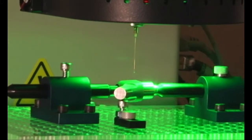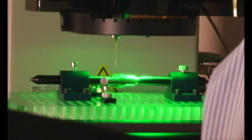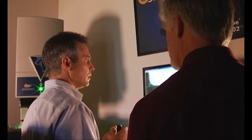The stylus itself is oscillating at a very high frequency, so it's an excited stylus rather than just a static stylus. And as that stylus is vibrating and comes into proximity to a surface, the surface disrupts its vibration and changes the frequency, and that change in frequency triggers a touch probe. We can do crazy things like measure the edge of a feather or profile a drop of water with a contact sensor. So this ability changes the way that you think about what you might want to use a contact sensor for. So the touch probe may be important in order to acquire data that can't be imaged, such as down inside of the sidewall of a bore. But you still need to be able to get down into it. So that's where the feather probe may also help, not just the light force, but also the tight quarters of operation.